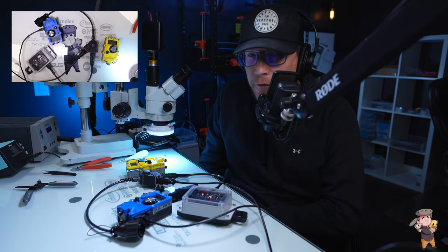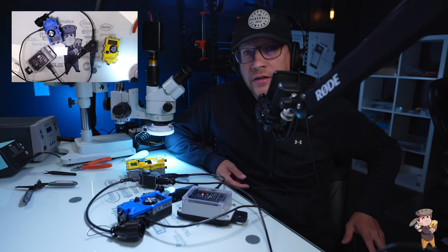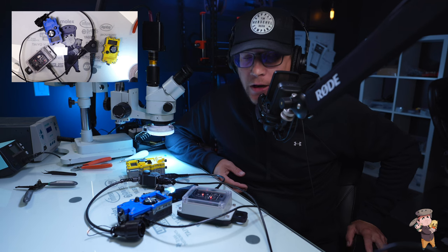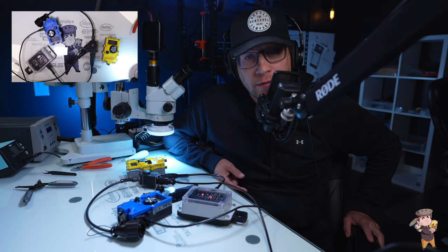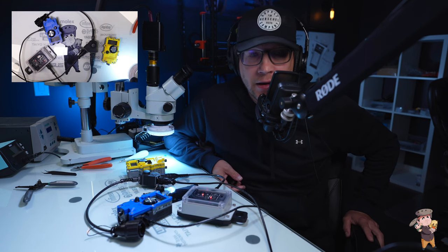Before I leave you on that, I have a demonstration to show you. It's called Frequency Hop. Frequency Hop is something I designed in 2019 because I envisioned that there would be a lot of remote sets on a site one day, meaning there's potential for crowding the airwaves. So what I did was purposely allow receivers to hear other hand remotes with different network IDs on the same frequency, in order to detect and then avoid interference.